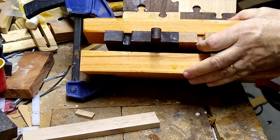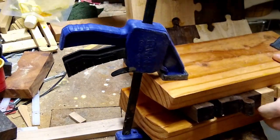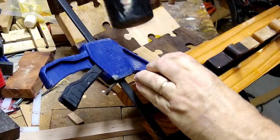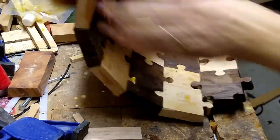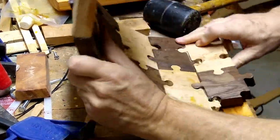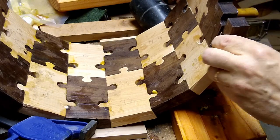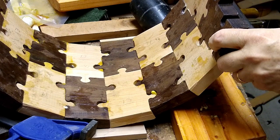In the end, I had to tap it quite a bit with a mallet to get them together. And you'll see in this one — eventually when I tap it, there will be a break. The red oak is naturally a little more brittle than other woods, especially at the seam, and once you've torrified it, it's even worse. So as we tap it — there it is. No big deal. I keep finishing this, get the seam how I want it, then glue up that piece that came off. A few more taps to get that joint just perfect, and then off camera I'll glue and clamp it — that joint will be basically impossible to find after it's been glued up and finished.